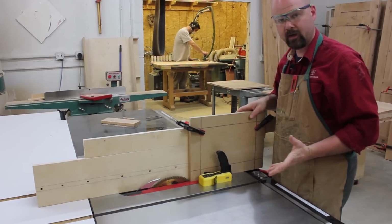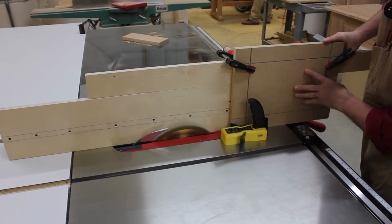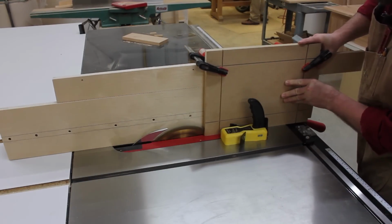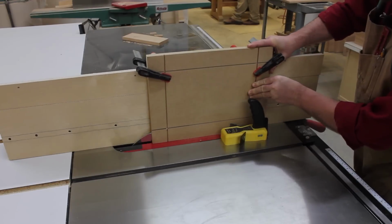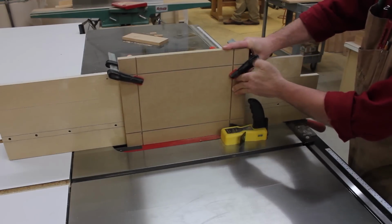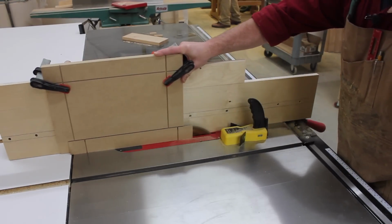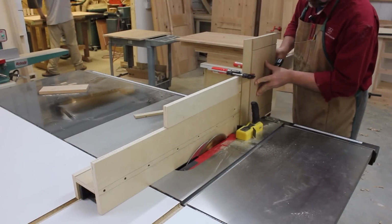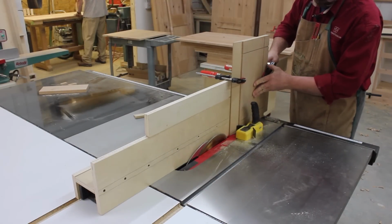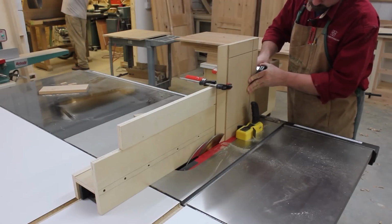All right, we're all ready to cut. I'm creating the bevel cuts by standing the panel on edge. This doesn't provide much space for the panel to ride on the saw deck, so the featherboard, auxiliary fence, and the guide rail I just clamped on are critical to ensure safety and control while making these series of cuts.